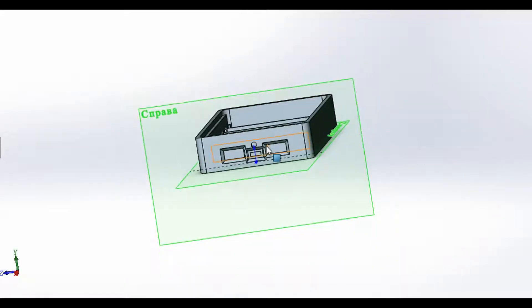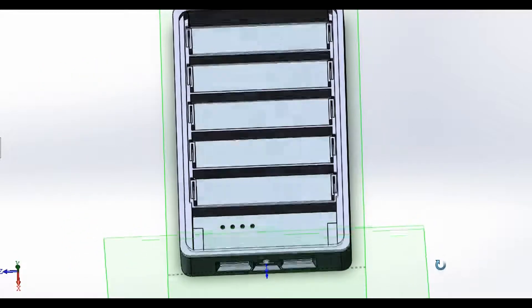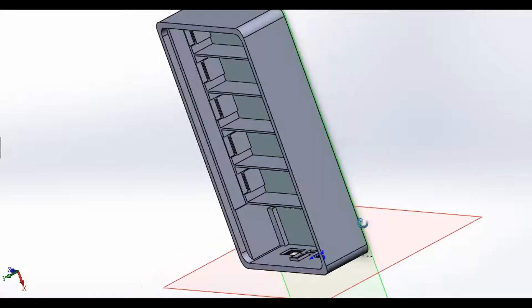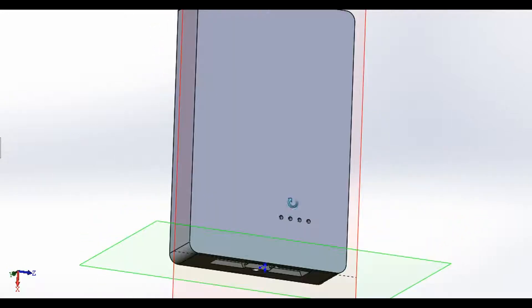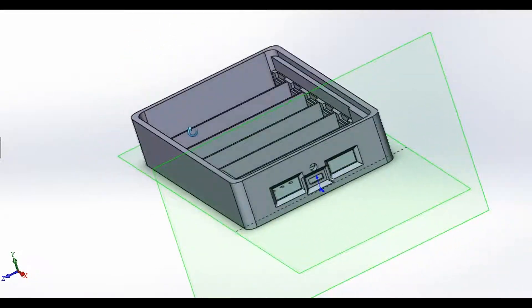I have taken all sizes of it and modeled such a box. It was made for 5 batteries of size 18650. That means that its maximum capacity is near 15000 mAh, because batteries of the same size with bigger capacity do not exist.